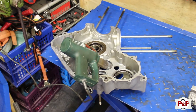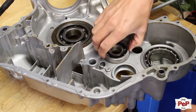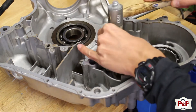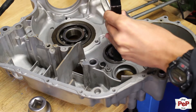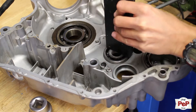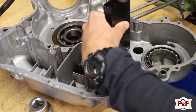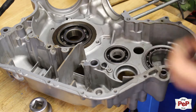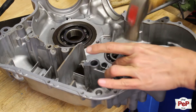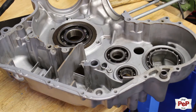First I had to install the bearings which I hadn't installed before. I heated up my half and the bearings were in my freezer. You have to be careful tapping in the bearings even though your half is really hot and the bearings are freezing cold. Use something that fits to tap it in — a nice fitting socket is always good. I didn't have a socket of this size, so I used a massive piece of steel from my hydraulic press, which worked great. For the other bearing I had a nice fitting socket.